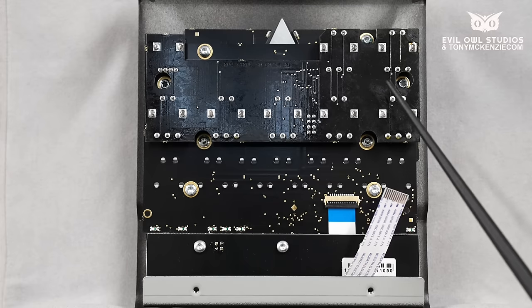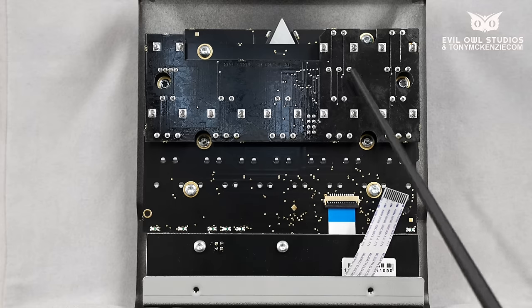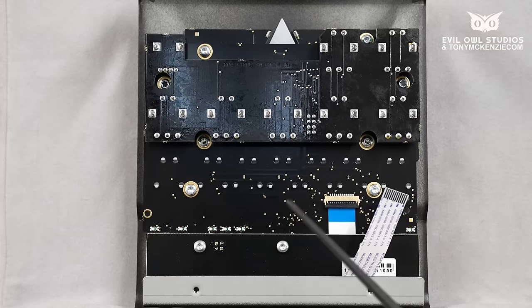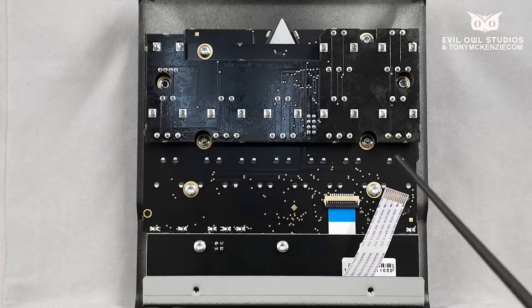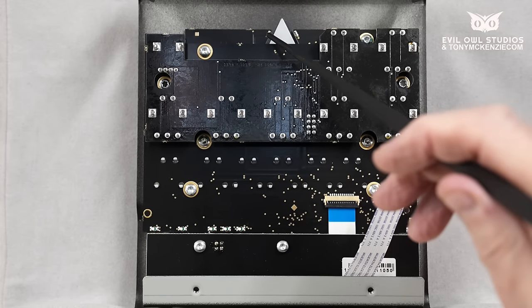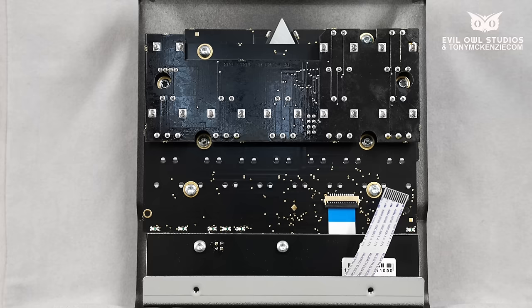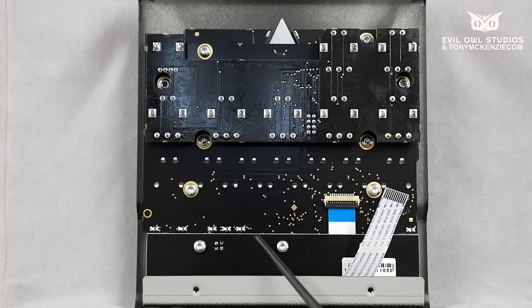But this is really just a method of controlling the other portion of the pedal. You can see the quality is actually pretty good. However, I can also see the pots on the side down here. You'll see a quick picture on the screen right now of those pots. They're relative to Marshall pots, in my opinion, give or take. You've got a bit in the middle there, and that's the bit that lights up from an LED on the PCB. Apart from that, as I said, you've got your four layers. This bottom layer handles the push buttons, and those are a pretty novel layout for push buttons, not like the very old-fashioned click-click or armour buttons. These have been brought more up to date than anything else, and very nice they are.